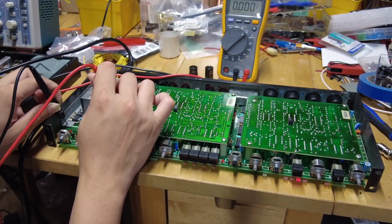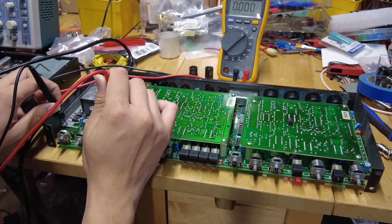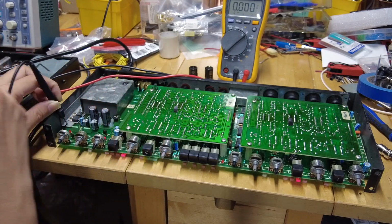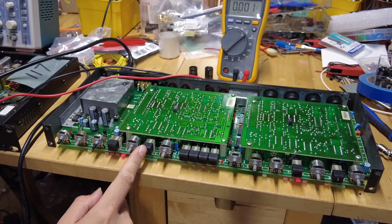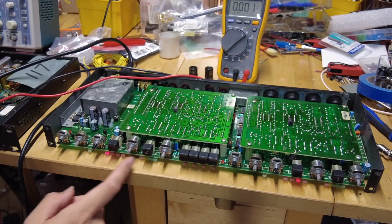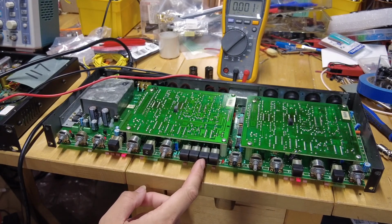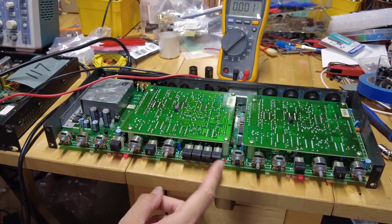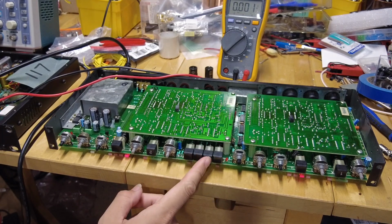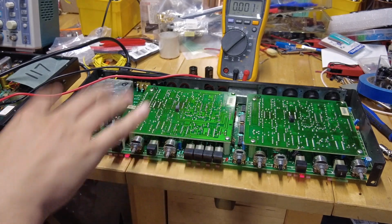So if I check the LM324, for example, I need to look at the data sheet of the 324 to see which pin that is, but it should come with the voltages coming in, because if we look at the modes and everything, they are working. So as you can see here, they are working just fine. So we know for sure the switching logic there has no issue, right? I know in chorus and flanger you have the link mode, you have the input mode too, right? For example, the sweep, the cross, maybe I flipped it. I got flipped because this unit is upside down.